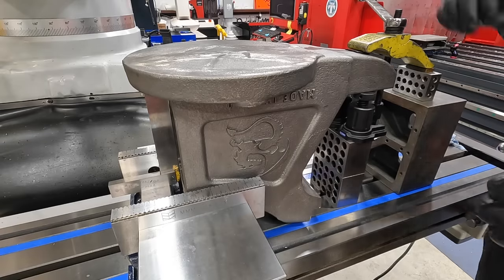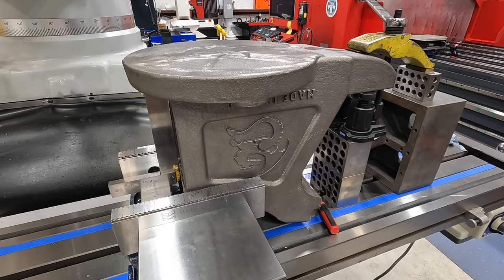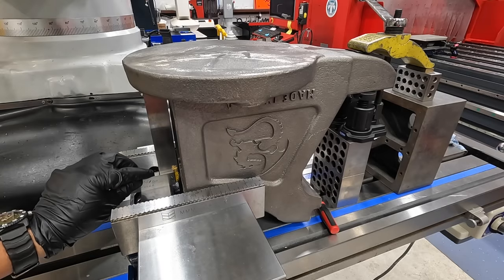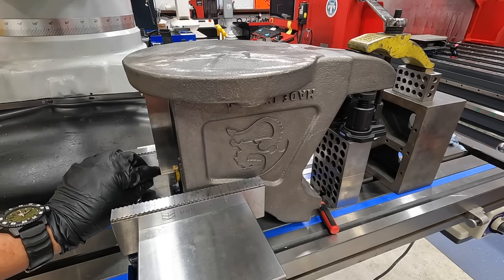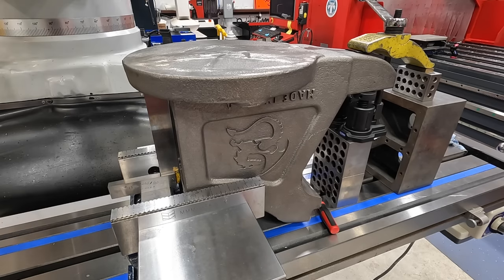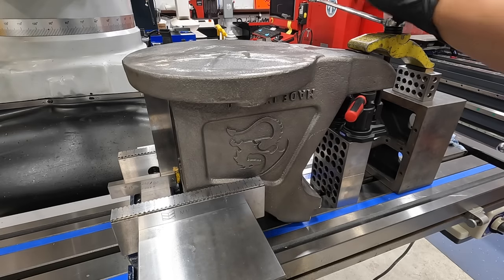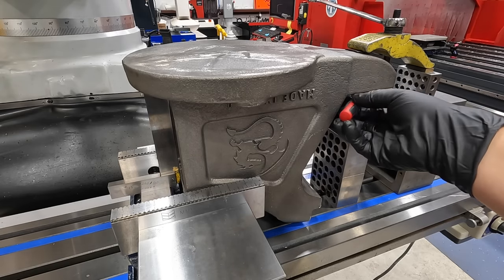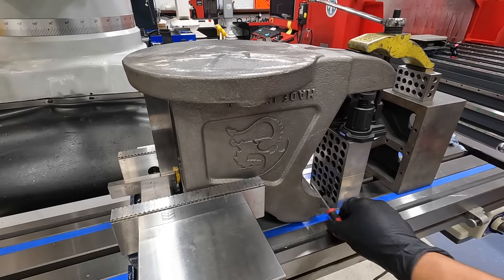All right, we got a wrench there. I've got another tool that we can use right there to adjust our jack. I've got the backside machinist jack down so that we can just use one to adjust it. All right, and I'm gonna go ahead and check our machinist square here. We definitely need to go down a little bit. Dang, did I already put it that tight? It would help if you go the right way. We need to go down, so screw it in.